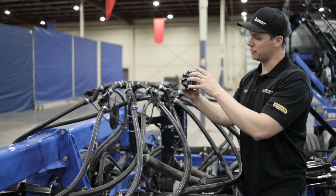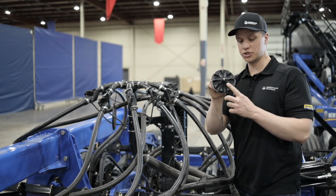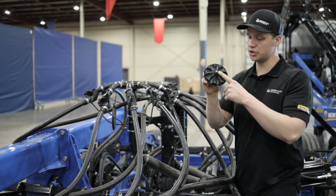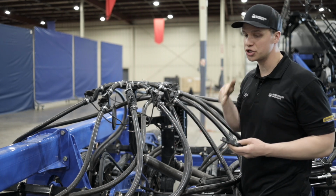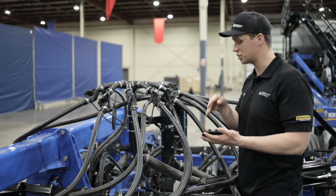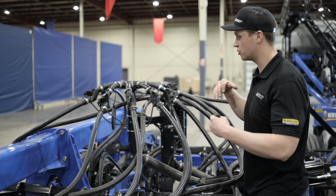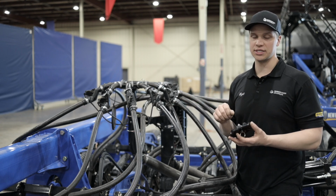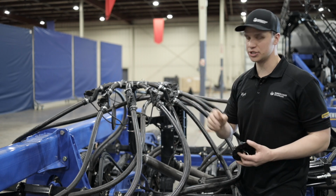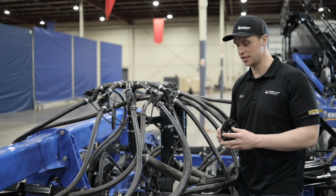they will be spread out evenly and smoothly turn, change direction into your secondary runs. So there's not a sharp, harsh change of direction. It's a smooth transition from primary to secondary. And those dimples will create that turbulence so that seed is nice and spread out when it hits this easy flow header and smoothly transitions to your opener. So that is the purpose of those dimples in the seed towers.